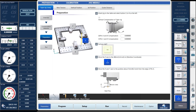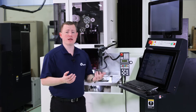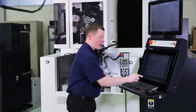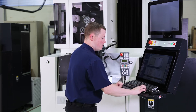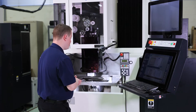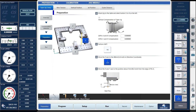Next, you're going to perform an AWT — automatic wire thread. If the wire isn't already threaded, you're going to thread the wire. Then we're going to move our Z-axis to 1.6 inches or 40 millimeters in the machine coordinate. Then the last item here is we're going to set our Z-limit so we don't crash down on top of the jig by accident.